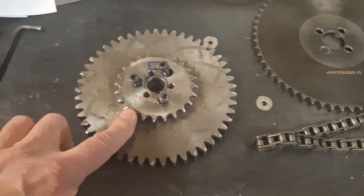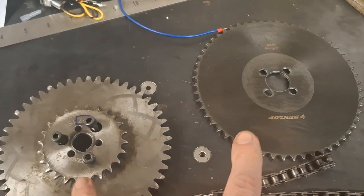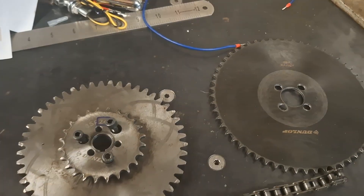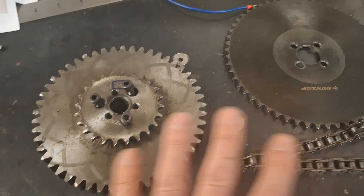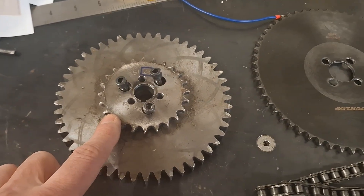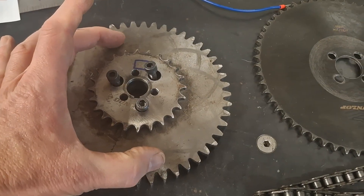Back on the bench, we've got to be careful of the overall diameters of the sprocket. That's 24 teeth and that's 57 teeth, which gives us a 2.375 to 1 reduction on the chain, plus the reduction we've got on the big ring here. It's only the chain we're changing, so I don't particularly want to change that ratio too much if possible.